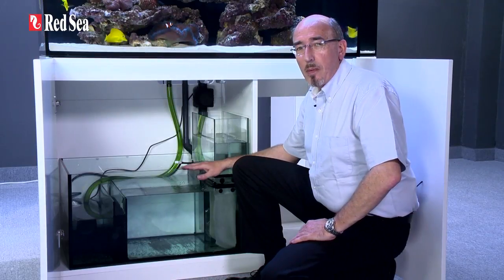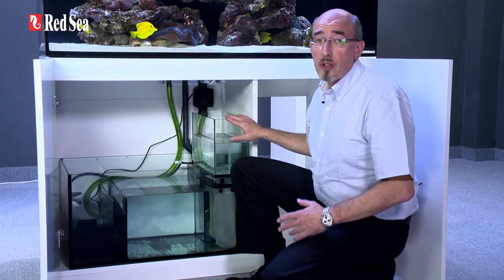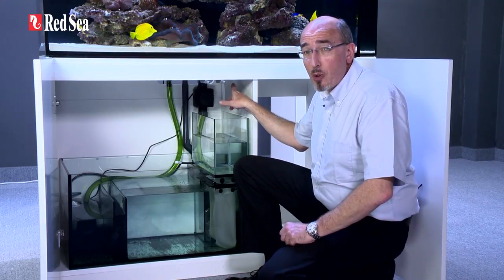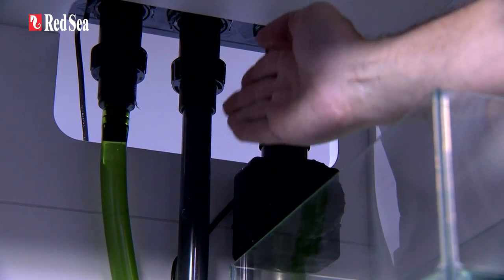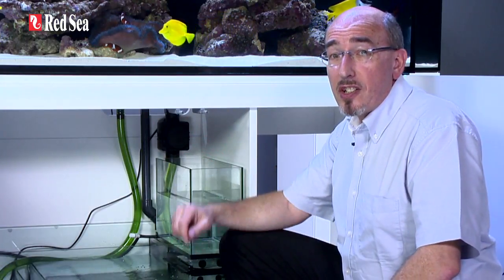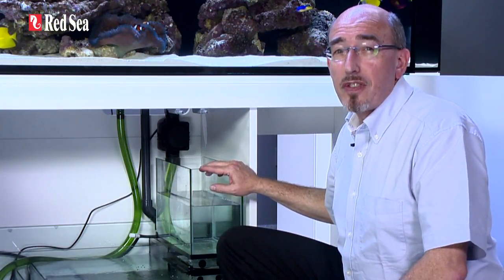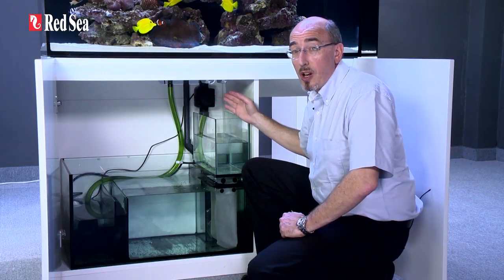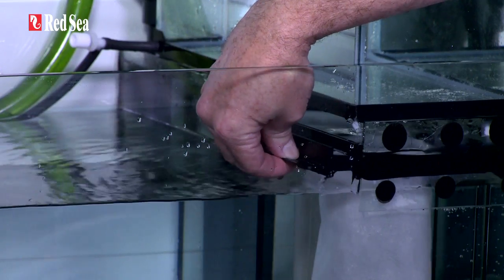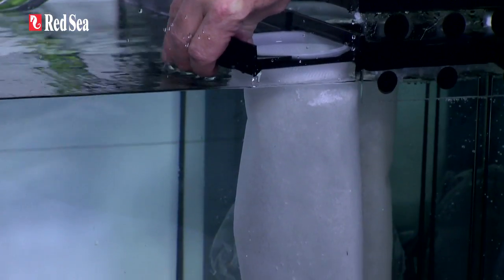Inside the cabinet are the sump and the reservoir of the integrated automatic top-up system, which holds enough water for about three days of evaporation under normal operating conditions. In the top right corner you can see the flow-regulated downpipe and the overflow bypass. The downflow valve, which can be completely disassembled for maintenance, is a custom diaphragm valve with fine adjustment for easily regulating the flow. All of the water passes through 200 micron filter bags located underneath the reservoir, and the filter bags slide out sideways so the reservoir does not have to be removed to clean the filters.